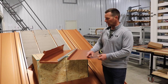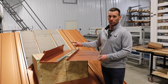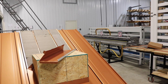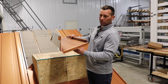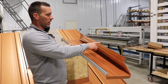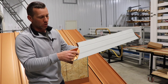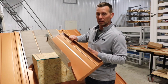Here we've got a regular piece of 138T and I want to show you how we get from this to the finished traverse panel. This is our first piece behind the chimney. The reason this traverse panel detail is so great is because we don't have anything special — we just use panels right off the roof. We take the roofing panel, cut the back leg off, and start to fold and fabricate. For the traverse panel, we turn down the sides. This part goes up against the chimney, bent to the angle. Then we run it out to where our sidewall stops and grab the top of our sidewall with a hook.